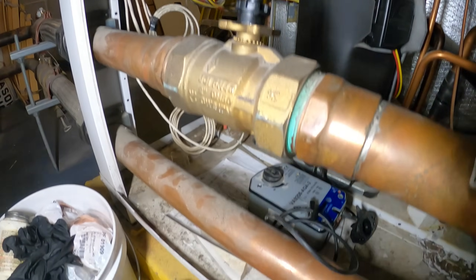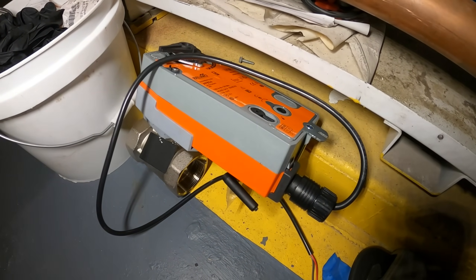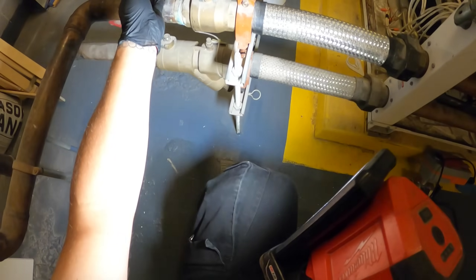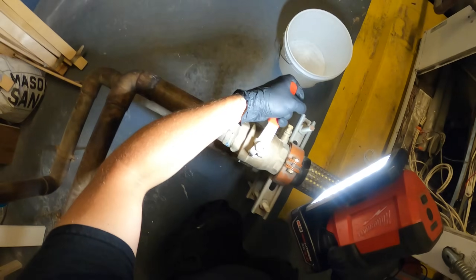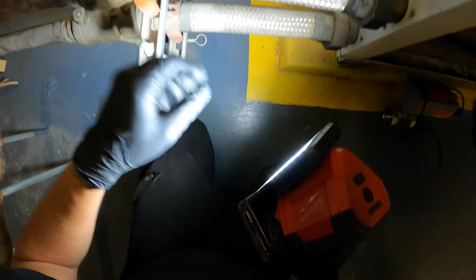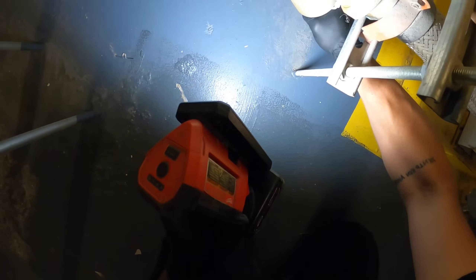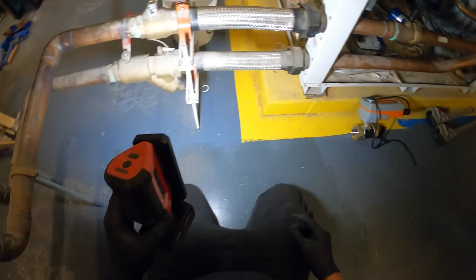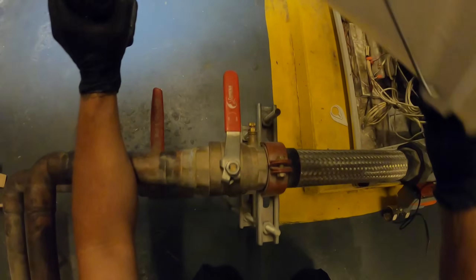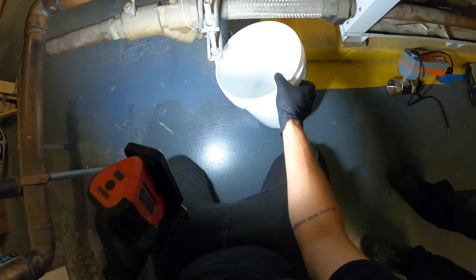As you can see there's not one here. We're going to put on a Belimo and keep things simple with the wiring. First thing we're going to want to do is shut down the water and drain this thing out. There's a strainer here — we need a pair of channel locks and we're going to drain it with this bucket. We can try to get in there.